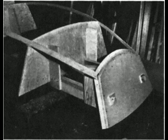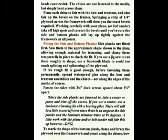Plane each chine to fair with the bow and transom, and also fair up the bevels on the frames. Springing a strip of quarter-inch plywood across the framework will show you the exact bevels required. Working carefully with your plane, or belt sander, take off high spots and correct the bevels until you're sure the side and bottom planks will lay up tightly against the framework at all points.